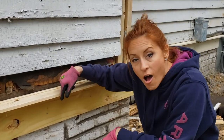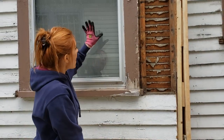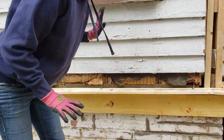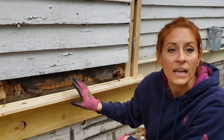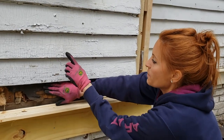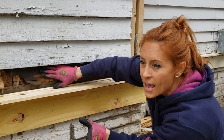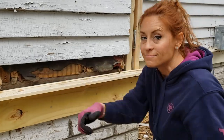This is the piece that was cut off by the idiots - it's a little drip edge. So as water might run down, it hits here and comes out and drips down and not into your foundation. We're going to put the final clapboard up under here, and it's going to be beveled just like this. It's going to sit here and then we're going to add our bed molding, which goes right up under here. Then we got to caulk it and paint it and we're done.